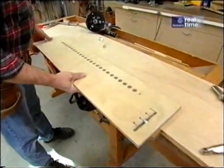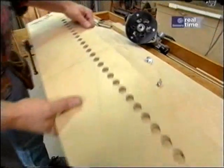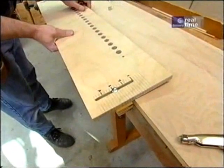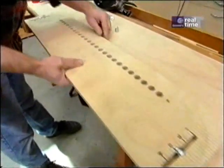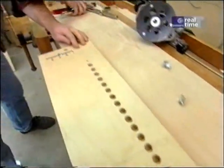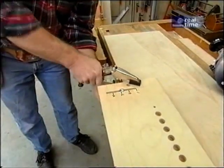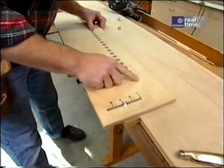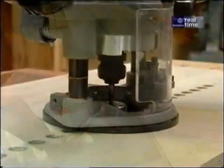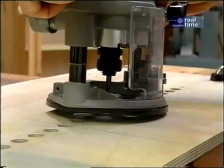Let's take another look at the prototype. On the outside we see the three-quarter-inch pine boards, the panel. On the inside we have one-quarter-inch thick plywood with holes in it for the adjustable shelf pins. Because those are dissimilar materials, I don't want to glue one to the other — I'm just going to set it on dry and nail it with some 5/8-inch brads, only along the back edge. Now I'm ready to make the holes for the shelf support pins, and I'm going to use this homemade jig. It has a fence that I can adjust for the distance I want the holes in from the edge, and a center line that I align to the center line of the panel. I clamp this in place and use my router with a 5/8-inch collar and a 1/4-inch bit.